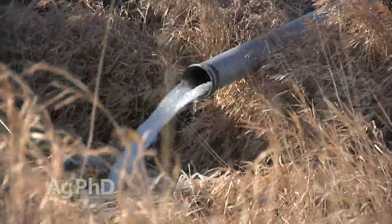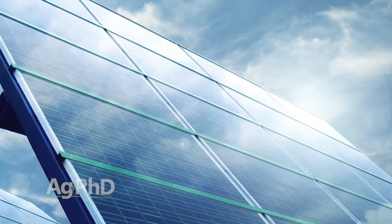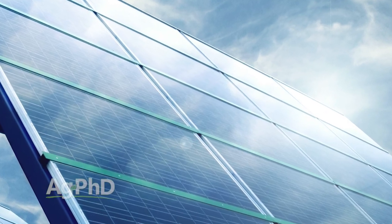If you're going to have a lift station and run a pump, you have to have power there. A lot of times people will run electrical lines out to it. We get questions about solar power, but the problem is you might be pumping a lot of water. We have one lift station with a 7.5 horsepower pump, which takes a tremendous amount of power, so a lot of times it's not feasible to run solar — though some people could do that for a very small lift station.